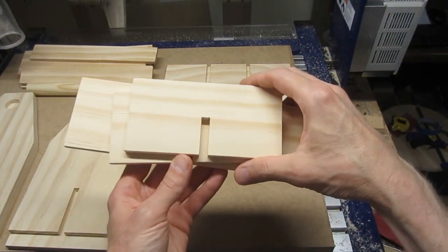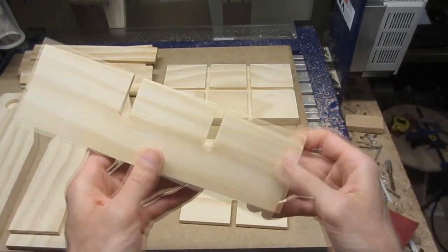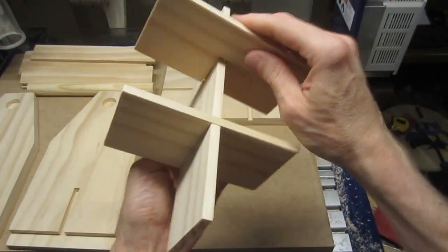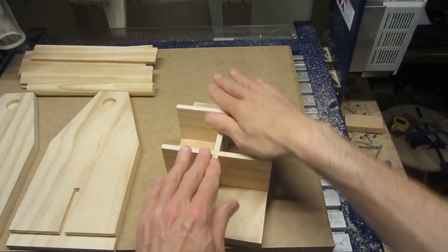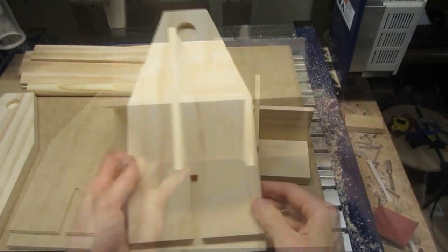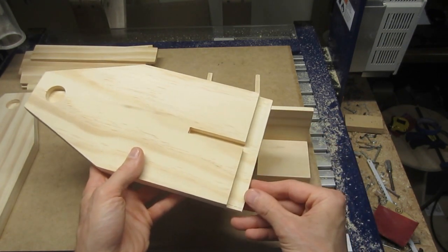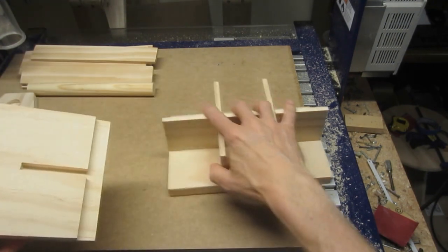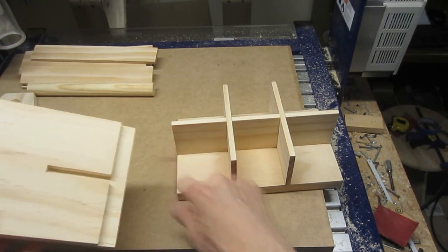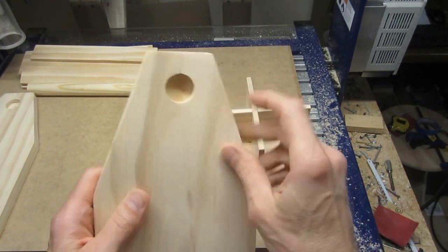The bottle divider itself is composed of 3 separate pieces. Notches in the material, along with dog bone fillets, allow the pieces to slide together. The assembly then fits into the grooves on the bottom piece. The end pieces of the caddy join the bottom piece via a rabbet joint. There's also a groove with dog bone fillets that locks the longer portion of the bottle divider into place. Finally, there's a pocket that receives the dowel handle.